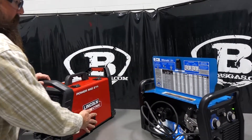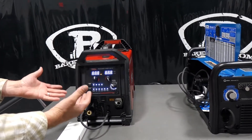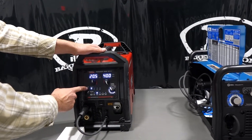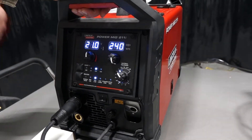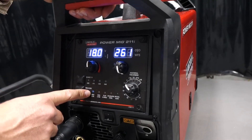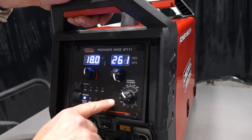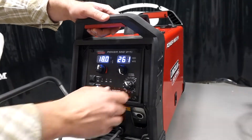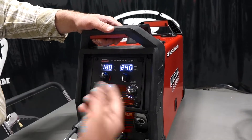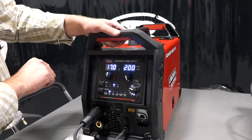On the Lincoln, the power switch is on the front with a nice bright LED display. You change wire diameter by toggling the button. We're only hooked up to 110 right now, but it will run 0.045 wire as well. In that process you just toggle through and tell it manual mode — C25, C100, flux core — and there's a spool gun down to it as well. Then it has your material thickness setting. If we go into C25, we can pick material thickness, but we're limited to 10 gauge since we're only on 110. You can toggle through and it changes our wire feed and our voltage.